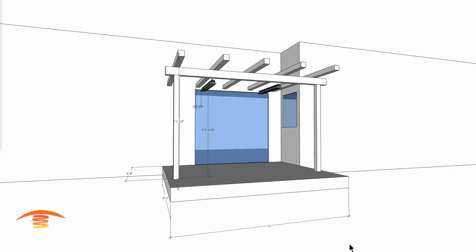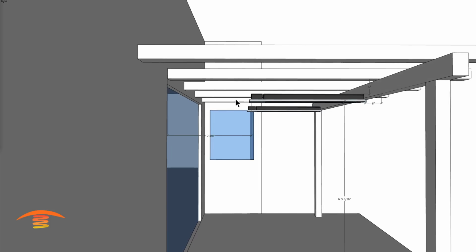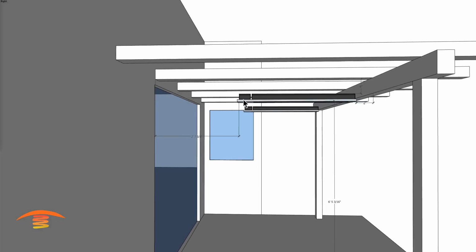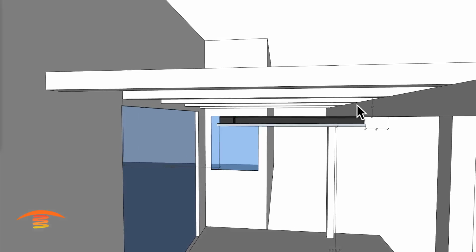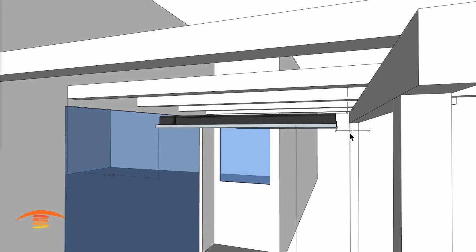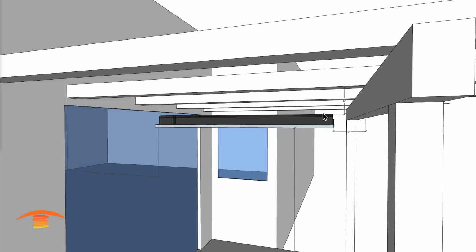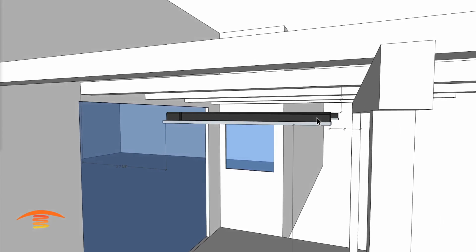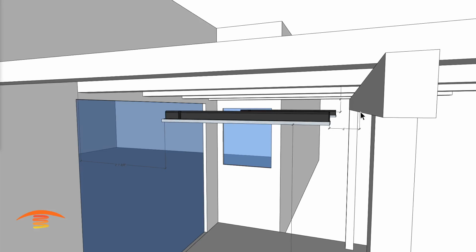Slimline unit first. So here we have the Slimline unit. My Slimline unit is actually 2 inches longer, so this would be actually 2 feet 9 3/4 inches roughly to this edge. So that's plenty of room for the clearance below the heater. The clearance above the heater, you'd have to drop it down 6 inches, and then from the side of the top is 6 inches, but below it's 18 inches. So you can't have this up higher than it is right now. You need to have this high enough to where it's not below this edge here. The bottom edge has to be at least the same height as below this edge.